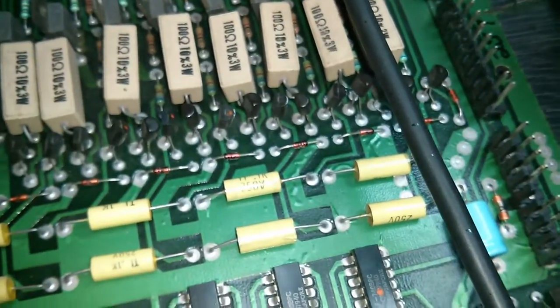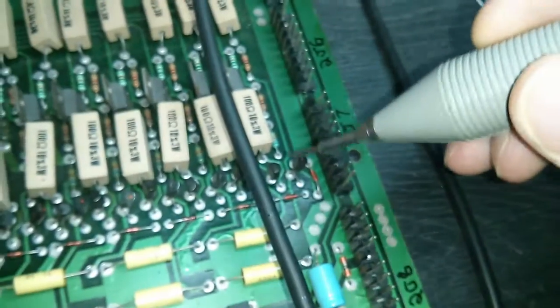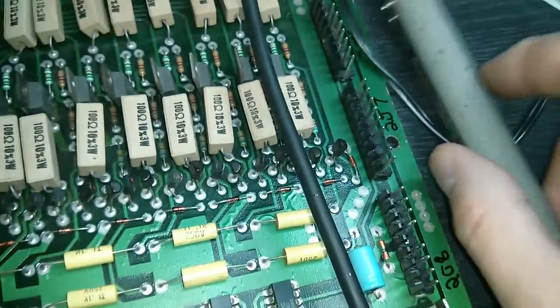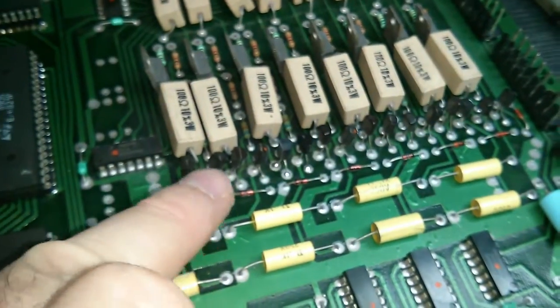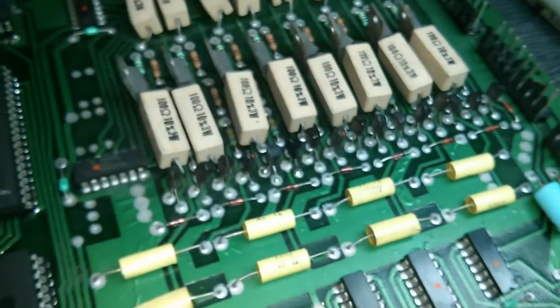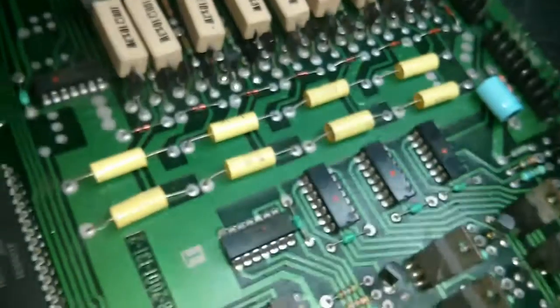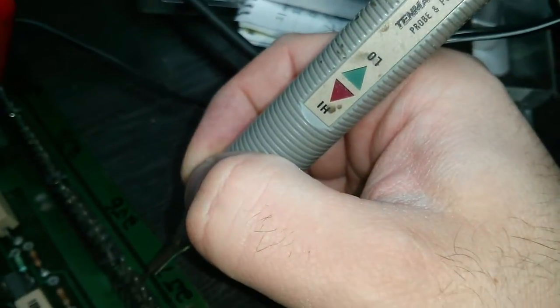Okay, so while testing, I found a short on lamp row number 3. That one is stuck low, so possibly a shorted transistor, but we'll check it out and see where the fault actually lies. Okay, so I've resolved the lamp row issue. It was the MPSA 14 and the 2N5060 SCR for column number 3. So if we just check that out now, 1, 2, 3. See that's now pulsing again. So that's that one fixed.